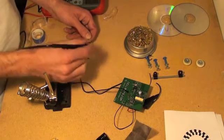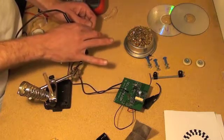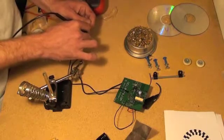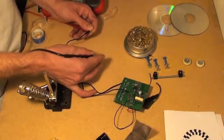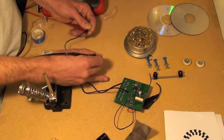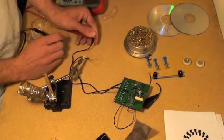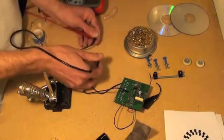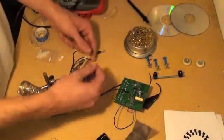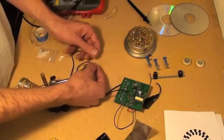This one is blue, so the tip is blue and the tip is the left channel. We move down, press our meter to the first ring and find out which one is next — the first ring is green. We move down and find out this is mic. On this particular headphone cord, the mic is copper colored. Finally, we go to the sleeve, which is the ring closest to where the wire comes out. By process of elimination, this should be red, but it's always good to double check. So now you know which one is which: tip is blue — left; then right; then mic; then ground.